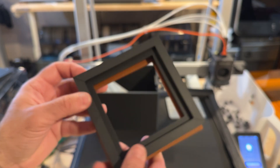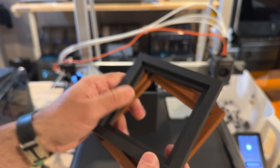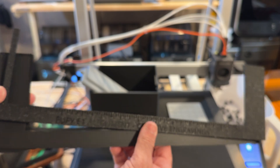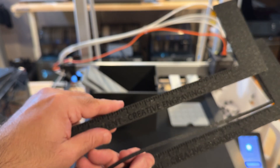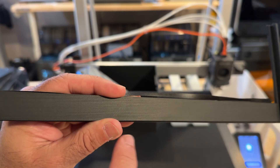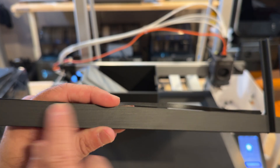We also ran some picture frames — we do picture frames in both PLA and ASA. Dimensional accuracy was solid and we had a really good experience with the first layer, so the actual frames turned out really nice. We also do rulers and alignment sticks. On the first one the brim wasn't really needed, so I turned it off for the second. The ruler and our branding came out very clear. The top layer, printed face down, came out really nice — no matte/shiny inconsistency or visible layer lines.